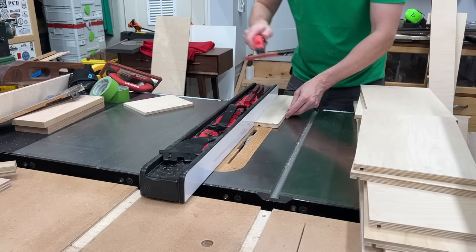I ran into major problems with this finish. The first two coats went down nice, but when I went to put the third coat on I was getting micro air bubbles all over the place — when those dry it looks like sand in your finish. I sanded and painted and just could not get it to lay down right, so I sent it over to my finisher Lazarus. The word around the campfire is Benjamin Moore Scuff-X semi-gloss gives a lot of people problems. Part of my problem may have been not letting the undercoats dry enough.